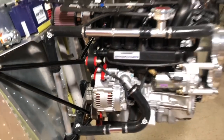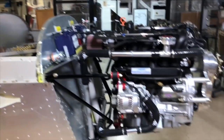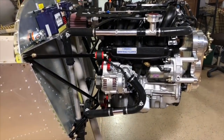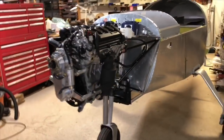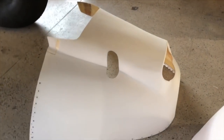The engine is now on your airplane. Up until this point, you would have had to support the tail of the airplane because the airplane is not nose heavy yet. At this point, the airplane will for the first time sit on its own wheels. Now, what I would do next is grab your cowlings and fit your cowlings. You'd have to put this turtle deck on with Cleco clamps because the cowling lays on top of that. We just completed the fitment of the cowling on this aircraft — it's a very straightforward procedure. There are a lot more details of how to do that in other videos. You fit the cowling and then put that aside.